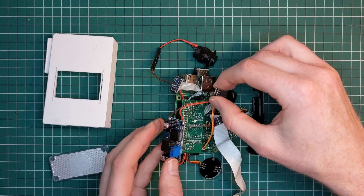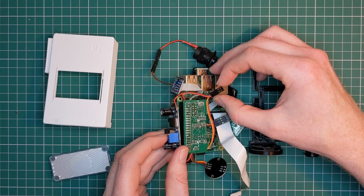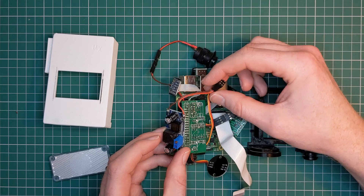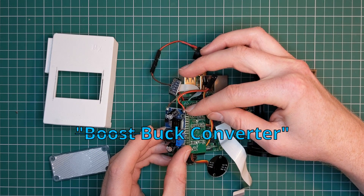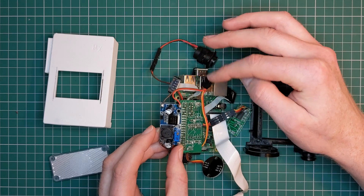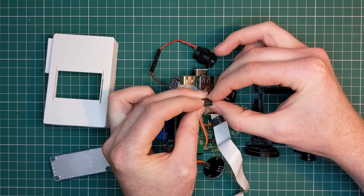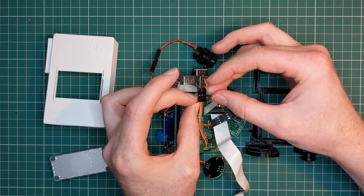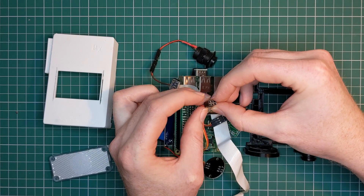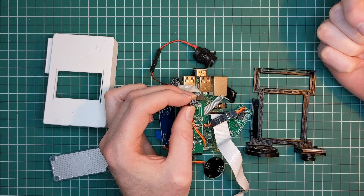One of the other changes I've made is to allow the head to work independently of the body. The idea is that the head can hot-swap with other devices. Rather than having the power and serial connection going straight down and connecting into the body PCB, I've split it out so that we have a boost-buck converter that can handle anywhere up to 30–40 volts and outputs a steady 5.1 volts for the Raspberry Pi. The other cables are the existing serial connections. With six connectors and only four active, the power is on one side and the other side is blank — so if assembled the wrong way around it either won't fit or won't do anything, rather than connecting power the wrong way and causing damage.